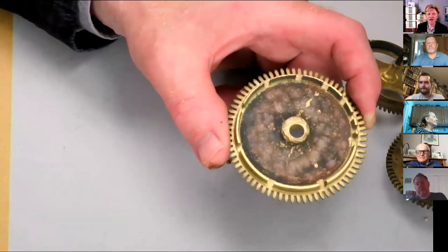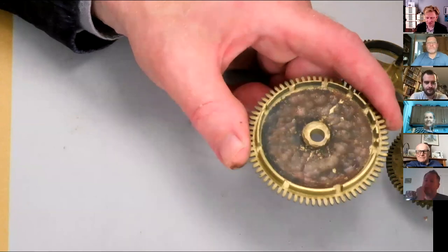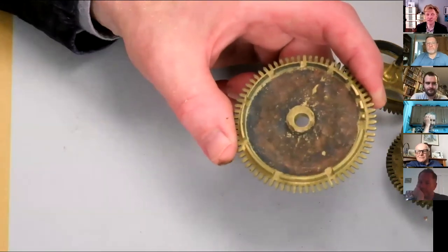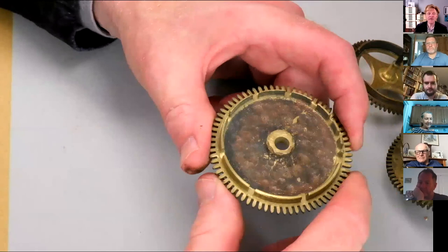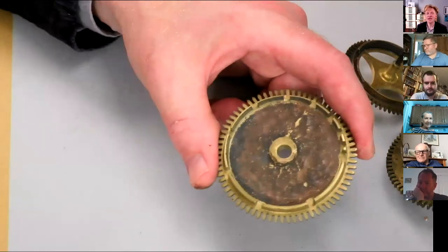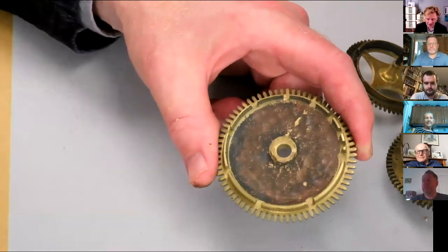If it's Grand Sonnerie, I think in John Taylor's book, if anybody knows that book, he maps out all the striking stations for his clocks, some crazy Grand Sonnerie things that strike thousands of times a day. But the station, I think it comes from a train stopping at a station. It's just the number of places potentially that the striking train can stop.